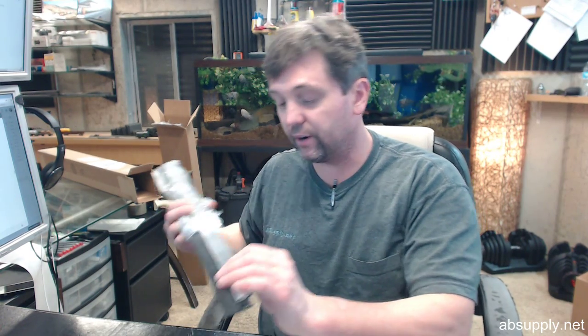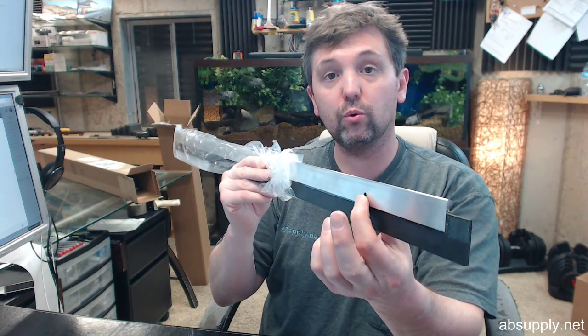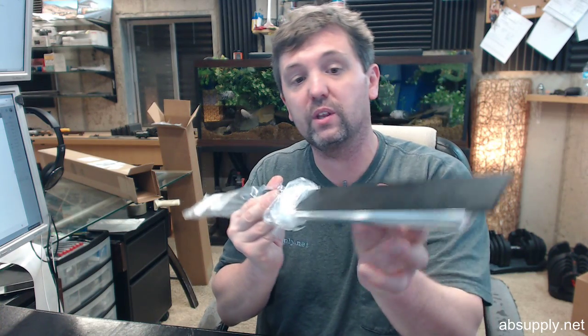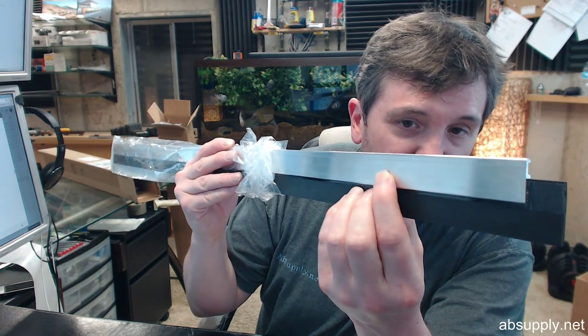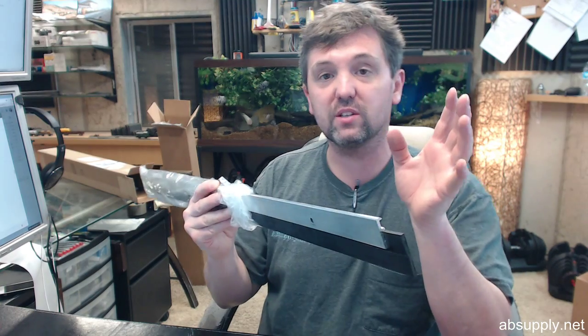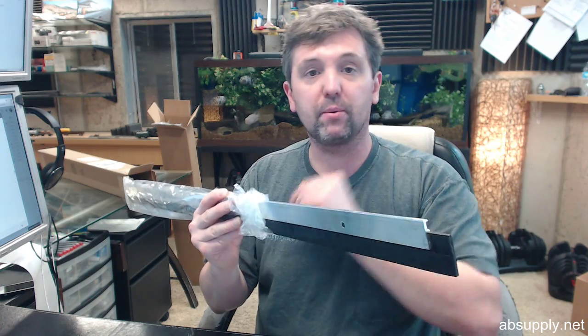When you're pre-drilling your screw hole, the drill bit has a tendency to walk a little bit before it pierces into the door whether it's wood, aluminum, stainless, fiberglass, bronze, steel, or hollow metal — if you have not used a center punch. As you can see this is held on with adhesive; it's when you install it via the screws that the installation becomes permanent. You might have to pre-drill a couple of times to open up enough of the material on the back side. If you ordered a custom length it will give you that slotted hole the proper distance from the edge and the proper center to center as well.